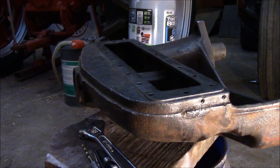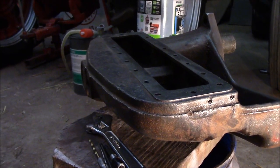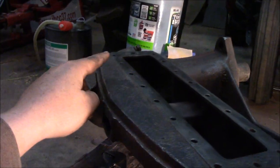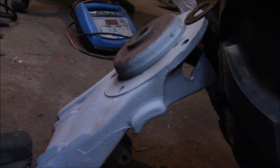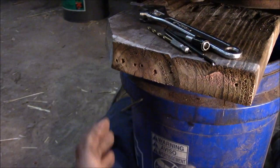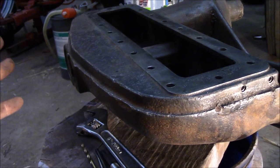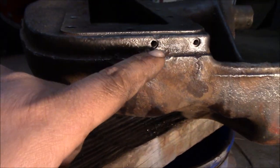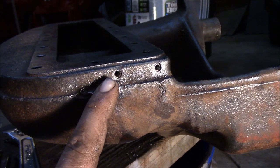International, being like they are, they love to save money, and this is one of their designs - they had to put everything in one part here. You got your whole steering system, your gearing and all for your steering, your shaft runs up out that way. You had your front end, this piece here is the bottom of the bolster, fits along in here, bolts up here, and then your front axle is across here. They put everything together, and if one thing happens - such as this here breaks - you either have to replace this whole front bolster, which means taking the whole front of the tractor off. These little screws here were broke off when I got it, and that's just typical Cub quirks.